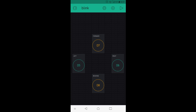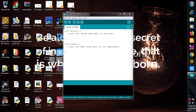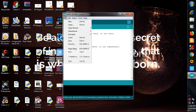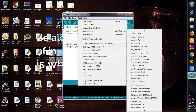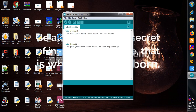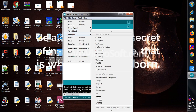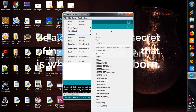An authentication token was generated and sent to my email. I copied the token and opened the Arduino software, selected the boards manager, selected the board as NodeMCU ESP8266-12E version 1.0 module, selected the COM port, and opened the program where Blynk is the library file.